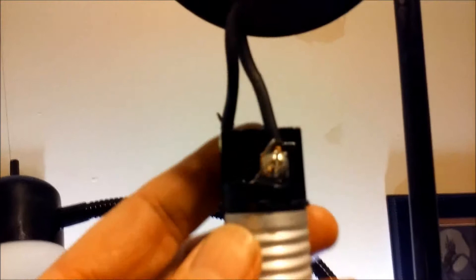I put a knot on there so it doesn't pull through. Wrap the wire clockwise so when you tighten the screw it tightens the wire — put it the other way and it would unravel the wire and make a mess. But this is the way it was from the factory too. This long piece sticking up — I'm cutting that off because that's a hazard.